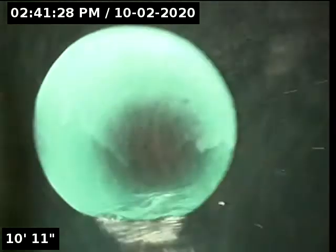So I've located the clean-out. It actually has a side slant here underneath the concrete platform. This other one looks like a rain drain or maybe a possible gray water. But this is where the line is here. We've got the foot counter here. The purpose of this inspection is to determine the overall condition and serviceability of the sewer lateral for this property to the city main.